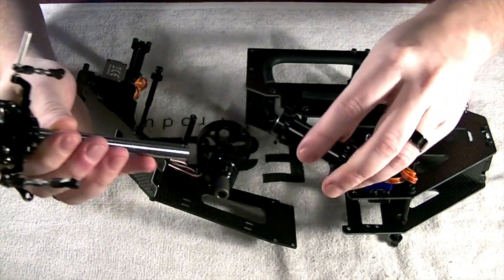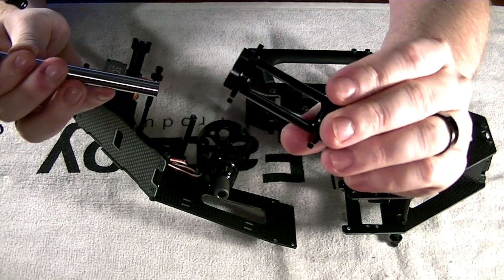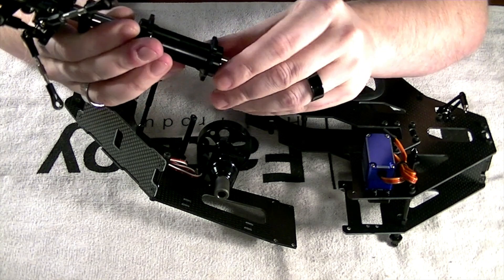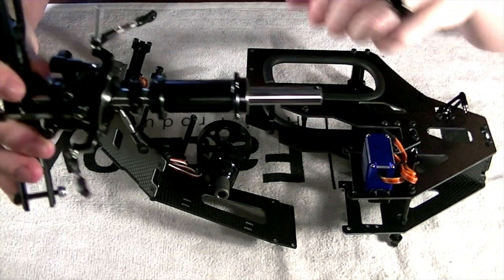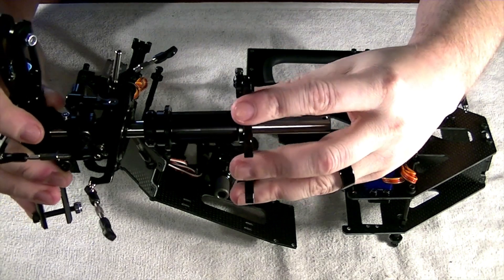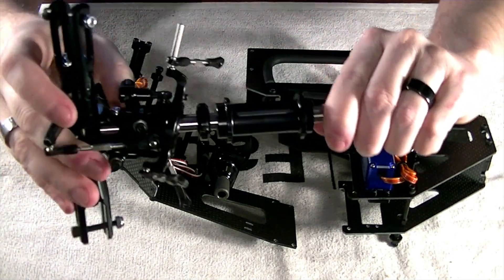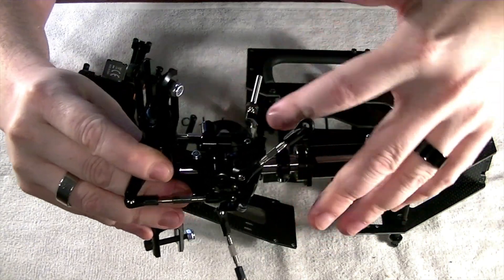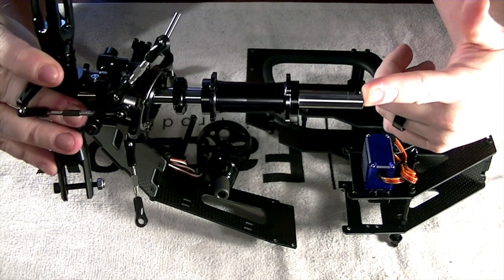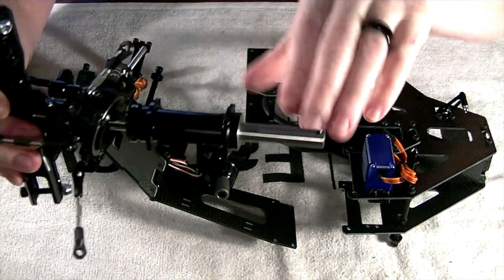As I'm building this whole machine, as we get to the part where we're going to unite the frames, I know it has a fully supported dual bearing cage around it. I always, always, always have the main shaft installed at all times whenever I'm assembling things related to the frame. I'm going to assemble and build the servo cage as specified in the manual, but when I go to actually install it, I'm going to take my main shaft out of my main rotor — just two locking bolts and the Jesus bolt — and I will leave the main shaft in at all times, no matter what.